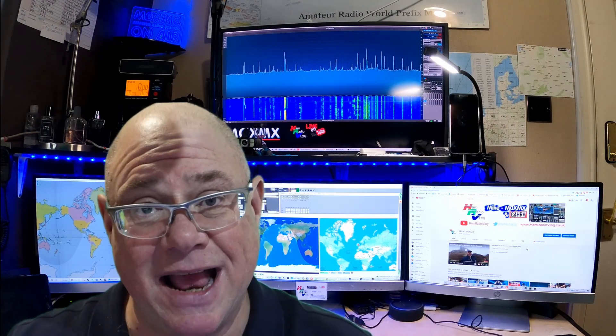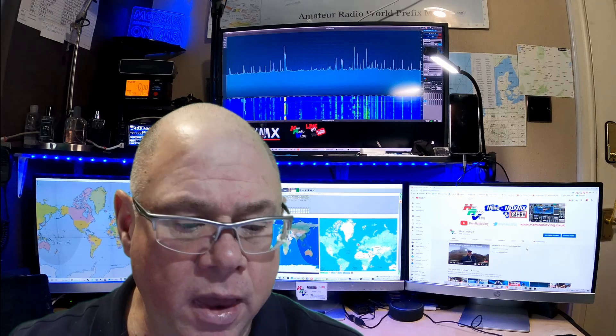The beauty is you can get into talk groups where there are many amateurs and it's quite busy. Rather than having this handy sat on the shelf with nobody talking on it, it can now be tuned into my node. Using the DTMF tones on my keypad, I can actually change the talk group I'm in — so it's very simple to go from EchoLink to HubNet just by using DTMF. You also have control and command from a PC or even a mobile phone app, but you don't need that — it really is as simple as using the keypad on your radio.